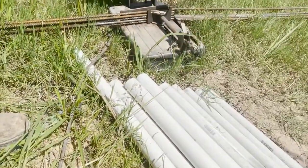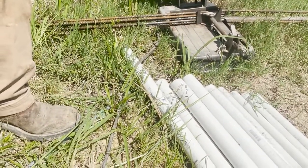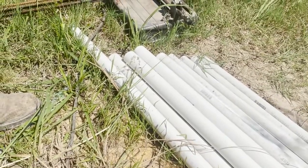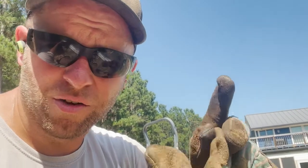But if you stand that bar up on edge, so see, I just cut 5 pieces of rebar, stood them up one on top of the other. So it's basically a tall, skinny piece effectively versus a short, wide piece. Stand it up so you're cutting on the narrow edge, you'll melt right through it. Just a little lesson for you, a little tip for you.